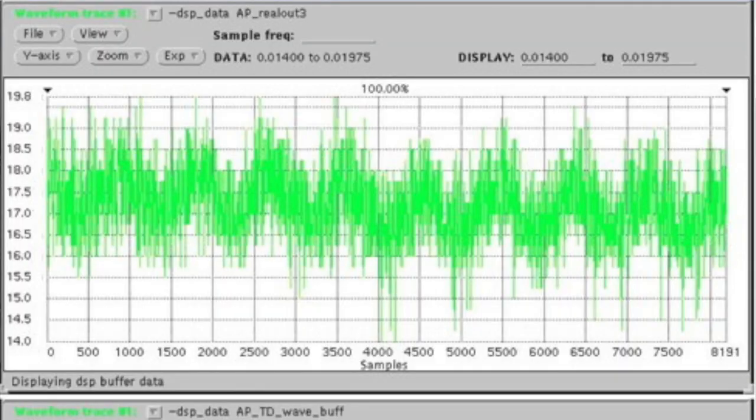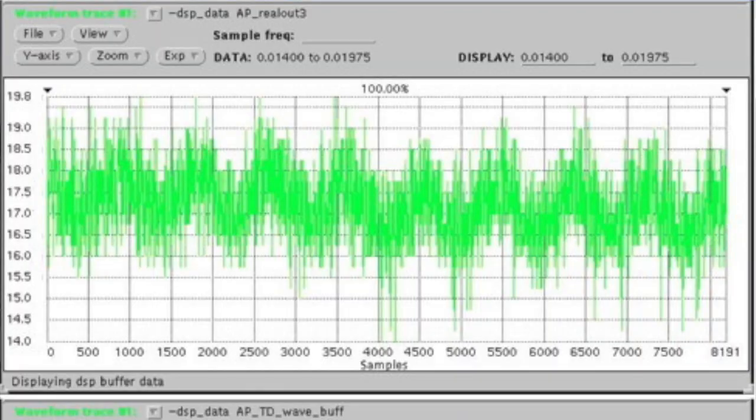You know, they all had degrees. So they took this nasty signal. They took 4 million samples, averaged the shit out of it, and they finally got some kind of a wave. I don't know what it looked like. And then they threw away the top and the bottom peaks for the most part, and then they took the peak times 0.707.